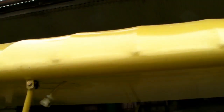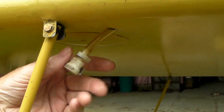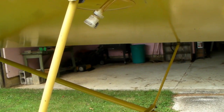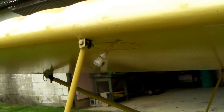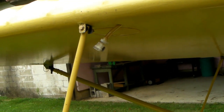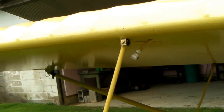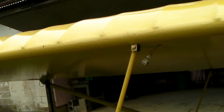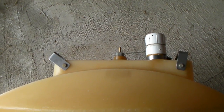The football tanks go on these jury struts — I don't have them mounted right now. I have a quick disconnect for quickly attaching the fuel line to draw fuel out of the football tanks. I needed the diverter valve because I couldn't see how you'd get them to draw evenly, so I only pull from one tank at a time. People think with one tank full and the other empty you'll fly crooked, but I can't really see any difference — five gallons isn't enough to affect it.